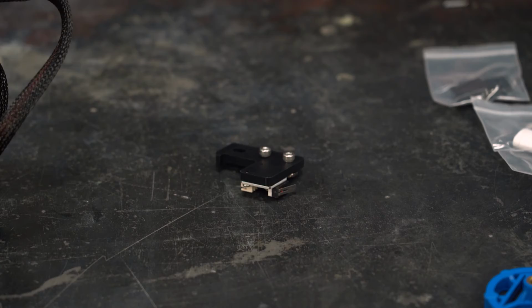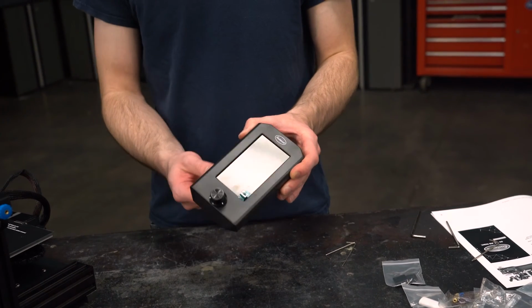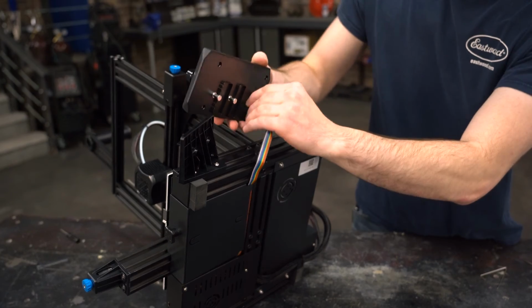The Z-axis limit switch can be installed to the side and connected. Leave this loose and we'll fine-tune its position in the next video. We'll install the control panel next. The easiest way to do this is to slide the screen out from the mount, install the mount to the side of the machine, plug it in, and reinstall the screen.